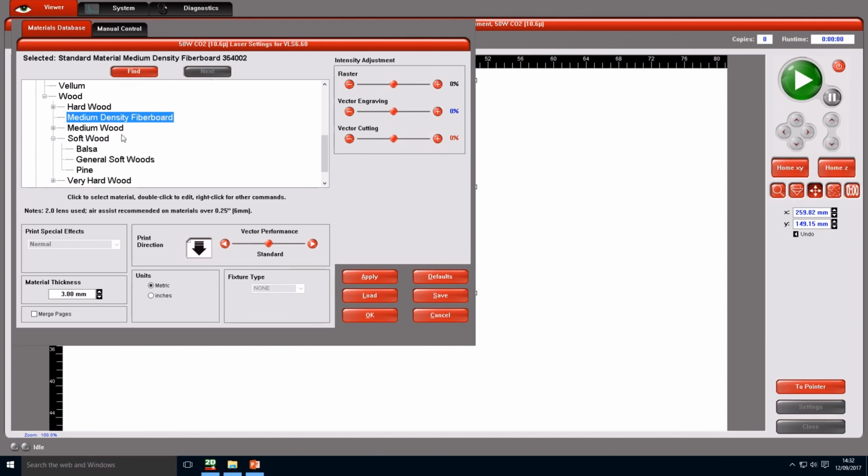I recommend you use MDF only up to 3 mm thick. The small laser doesn't cut the 6 mm. We're having lots of trouble with the 6 mm. Then we stop at 3 mm MDF. For other plastics, we can go up to 5 or 6 mm. Alright, the settings are already fine. It's standard settings. Students don't have to do anything.